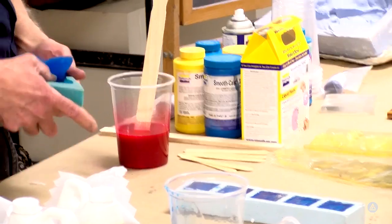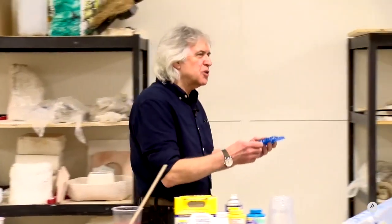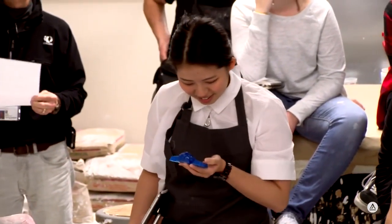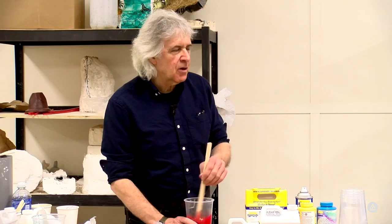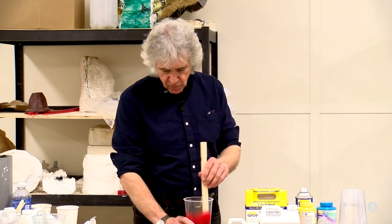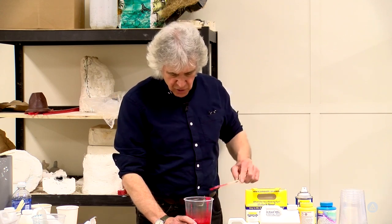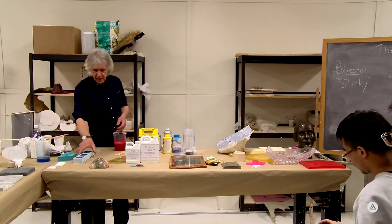So here is in the meantime, our little angel. As you can see, right now she feels kind of like a gel, like a gummy angel. She'll harden up in another 15 or 20 minutes. Yeah, that one sometimes takes a little bit longer to cure completely hard. It might be a little leathery. And they do make some resins nowadays that you can even bend after the fact. They make a resin specifically for these architectural applications where you can do the casting, let it cure, pull it out, hold it up onto the curved surface, and nail or tack or screw it into place. And there it will stay.